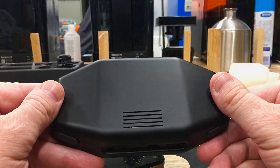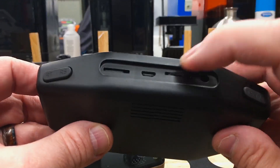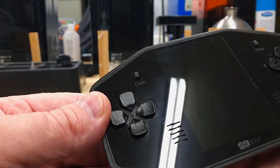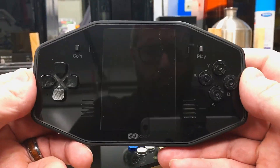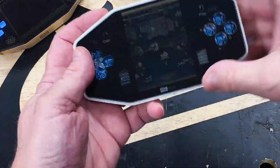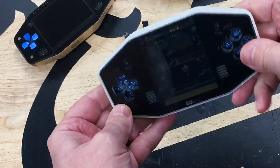The clear body was sanded with fine and microfine sanding pads and then clear coated with a UV acrylic coating, bringing the body to near transparency. The black body was coated with ceramic coat — a ceramic-infused coating similar to Cerakote but a little cheaper. It feels like a tactical weapon: durable with a ceramic but silky feel. Sliding the sub-assembly into the body, dropping in the desired D-pad, and sealing up the acrylic face completes the unit. This is one of my favorite builds and I'm pretty happy with the results.